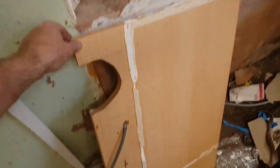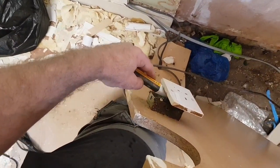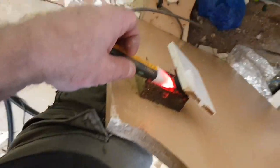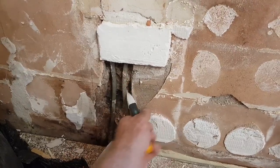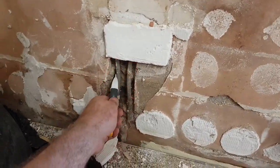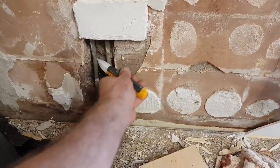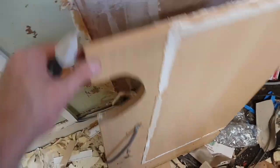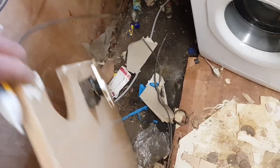I'm back in the kitchen and just thought I'd have a look at a few different things here. Obviously you can't go off a volt stick or anything - these things don't test for dead, they only test if things are live like that. That's definitely live, but obviously that is not definitely dead - you can't test that with a volt stick no matter how posh they are. I'm just a bit surprised at the state of this - this electric just kind of rips out and abandoned on the floor here, and live.